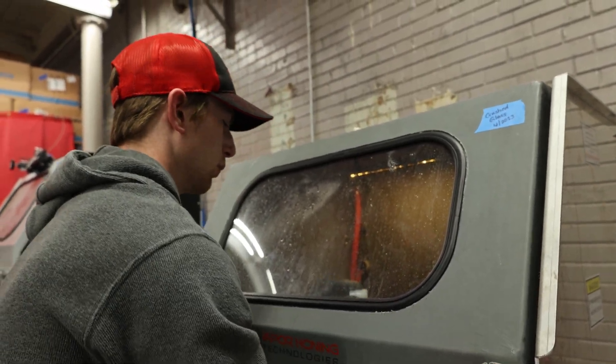Also, rinse this little white cap off before you put it back on, because any sort of abrasive that you get in those threads is just going to decrease the life of your cap. I'm going to rinse this back off, because abrasive will get anywhere that you don't want it. You can simply put that back on, and make sure that your black nozzle in here — that's that boron carbide tip we're always talking about — make sure it's pushed firmly up into the end of the cap, because when it slides back, that can also cause issues. Screw this back on, make sure it's secured firmly, and turn your air pressure back up.